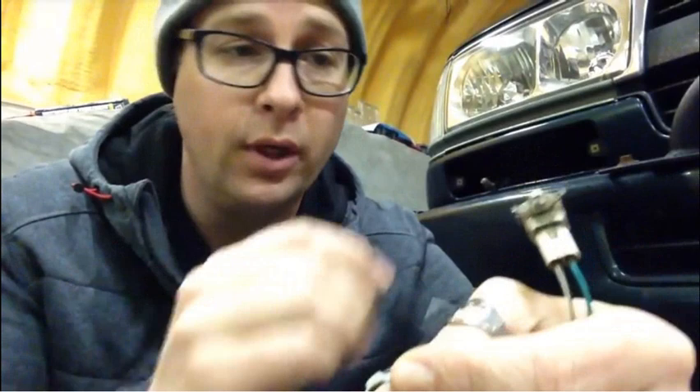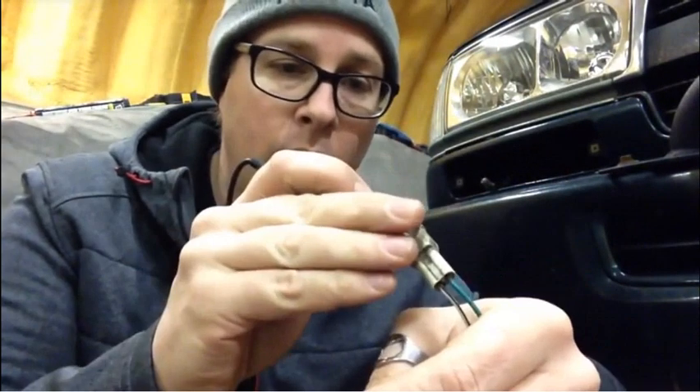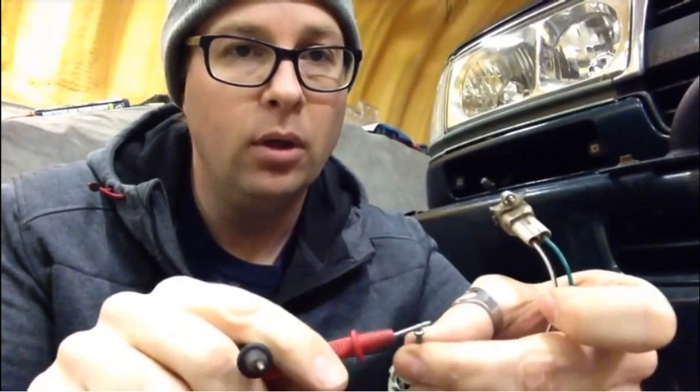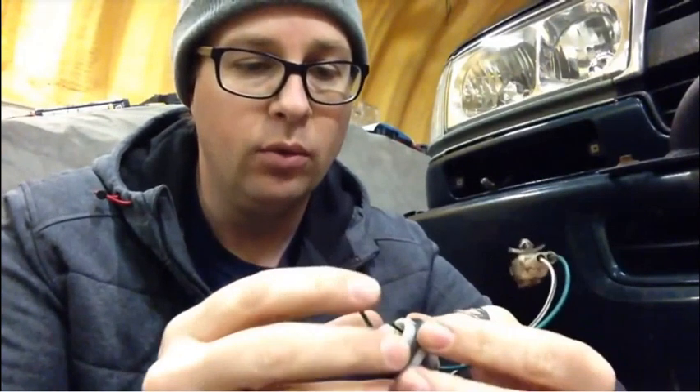I've pushed the wire for the center pin through. I'm going to grab my meter, hold it on that pin, and then probe the two pins on the other side. I'm not even going to look at colors — I know it's green and green, but I'll check both. I have no continuity to the white-black wire, and there I have a tone. So my green wire from the pin that contacts the bulb back to the plug is good. I can rule that out now.